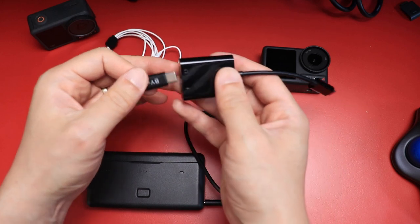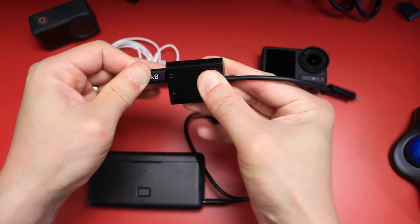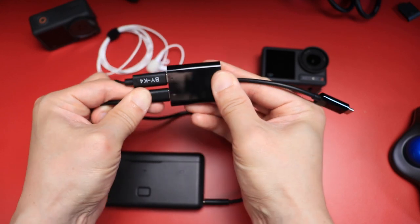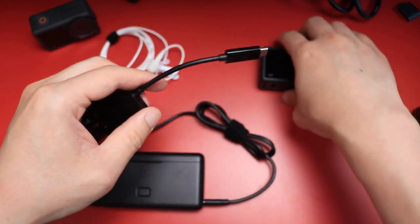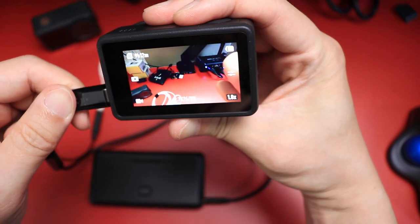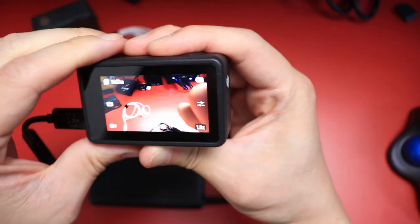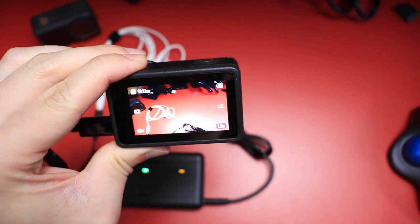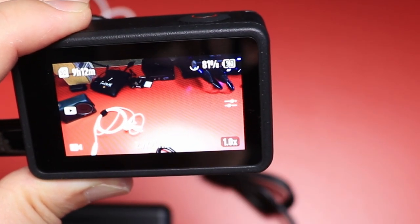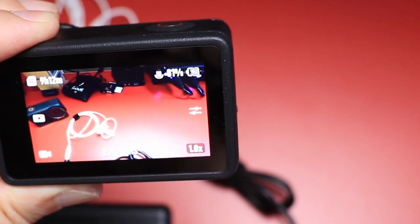Belkin does make a version with a USB-C for charging and a 3.5mm jack for audio, but I don't think that adapter will function the way we want it to, because that 3.5mm jack is potentially a TRRS that functions as a headphone out or phone headset rather than a straight microphone input. That's why when you use this Belkin adapter, you still need to use a microphone adapter like the Boya BYK4. To show you this all works: we take the adapter, plug in the microphone adapter and the mic, plug in the power supply, connect it to the camera, and we get the microphone icon and the charging icon on the Action 4 screen.